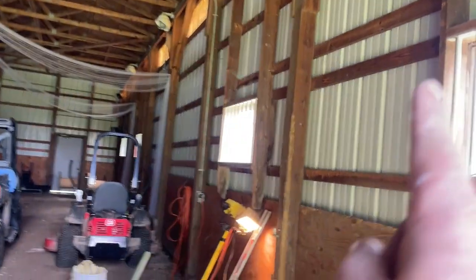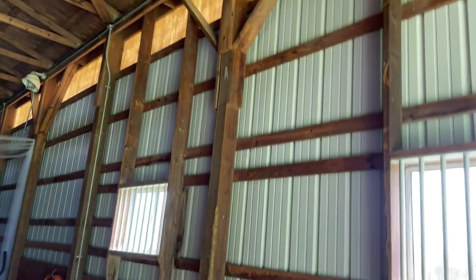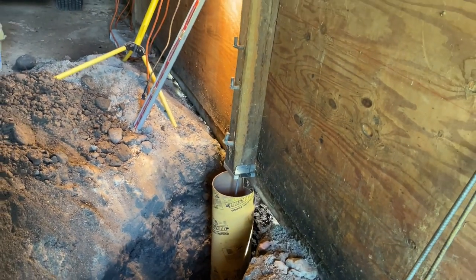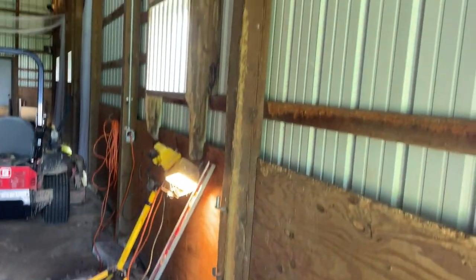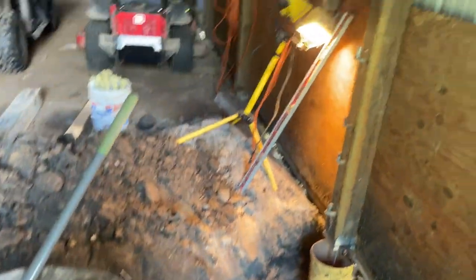I was going to brace up my roof because I'm cutting out a support post. My roof is not clear span end to end - I've got the higher roofline up there, so all I've got is this roof here, about 15 feet, resting on the interior posts and the exterior posts. A lot of these purlins on there didn't seem right - they were straight across - so I was going to support underneath. But looking at it, I thought it would hold itself, so I cut it out with a chainsaw and it didn't pinch the blade at all, which means there's pretty much no downward pressure on it right now. Which is good.